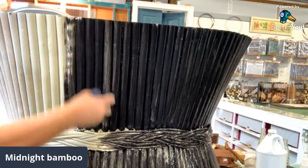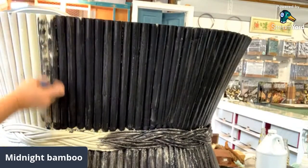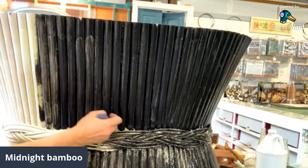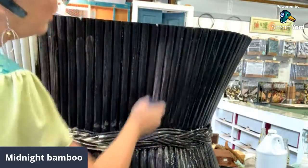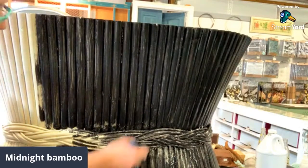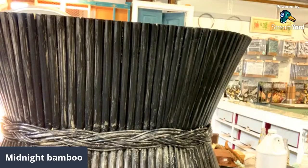So if you're wondering why I'm painting up and not down, it's not just to be different, but it actually helps make the paint move where I need it to without brushing down. If I were brushing down, I'd get to that, and you see all that paint that's globbed up right there? We'd have goop. We don't want goop. It's challenging enough when you have a textured surface or an architectural surface to make sure you get your paint where you need it to be without running it. And with that stroke, we are done with the first coat on this side.